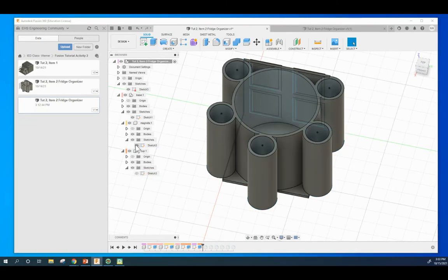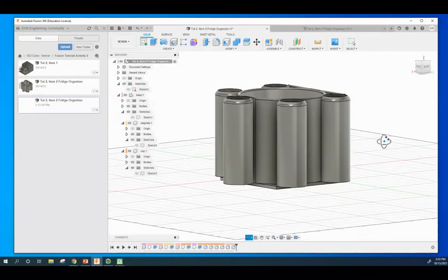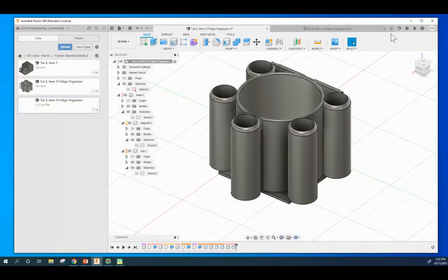Let me turn off all these sketches so you can see a little bit better. I did a fillet there - a rounding of the surface - a fillet right there, a fillet there, then filleted the inside, filleted this right here, and filleted the other side. Just to round off and make sure there weren't any sharp edges on the top of it. All right, that's the object. I'm going to go ahead and pause and get us ready to start it together.